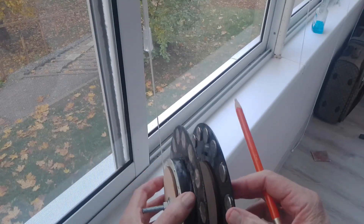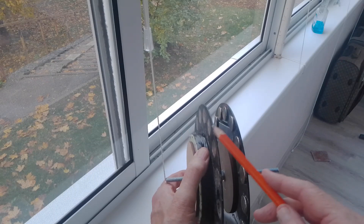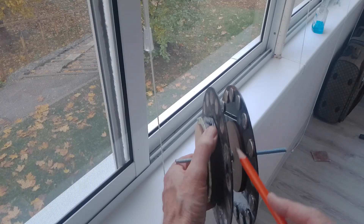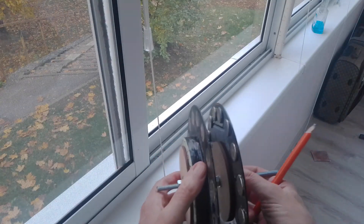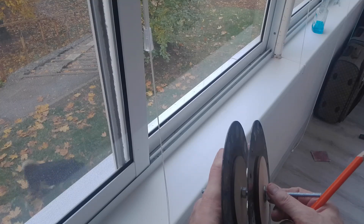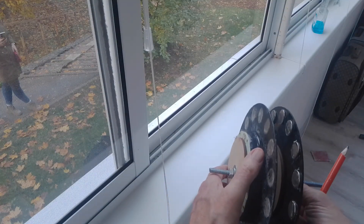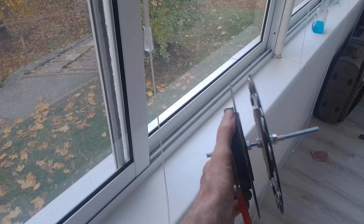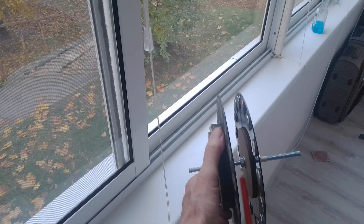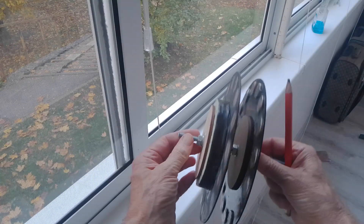And here is the trick — I'm going to do the experiment. So let's say the motor coil is on this side. I'm putting eight motor coils in here. I have a video of where I've already been running this from a couple of years ago, and I can link that down below. So when I got here this year, I took it all apart and fixed it up. I have nuts in here so I can adjust the air gap distance — it's going to have about 1.5 millimeters on each side of the coil, maybe a little less.